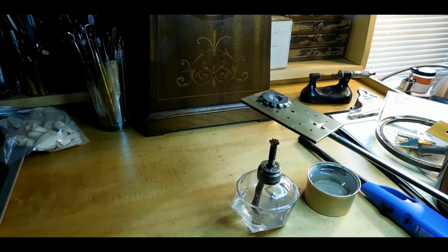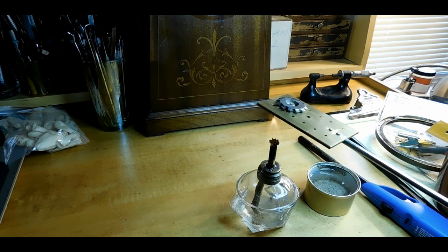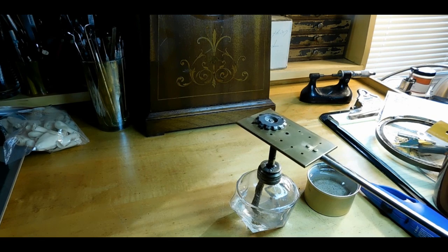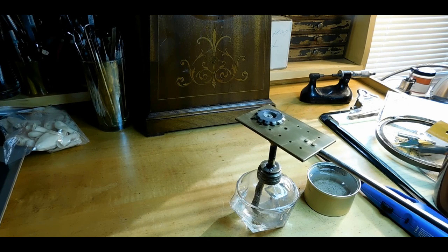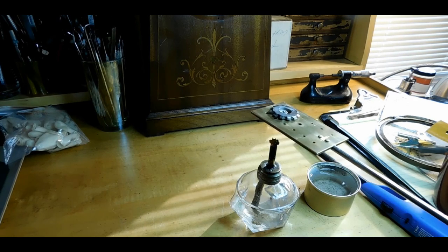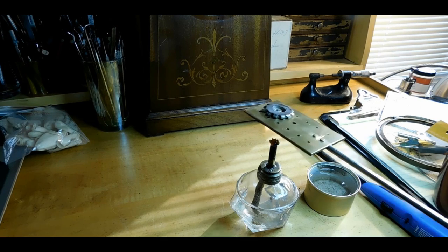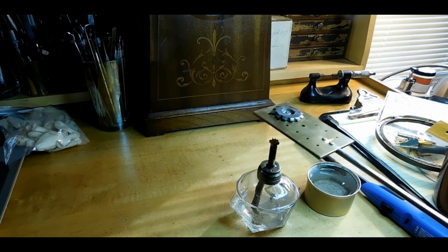Now I use the boric acid. And you'll notice that I didn't put it in a wire cage, and that seems to be the way that most people do this. I used to use a wire cage, and then I got one where one of the arms didn't get hardened correctly. You can't really see the tips of the cutter when you've got it in a wire basket, and I thought I had it red, and it just didn't quite work, and I had one that wasn't hardened, and of course all that work for that cutter just went to hell.